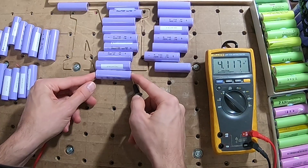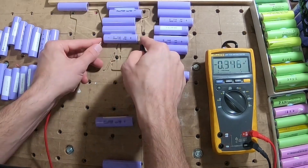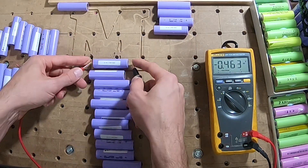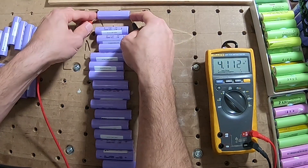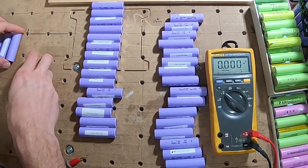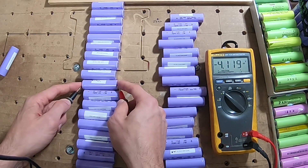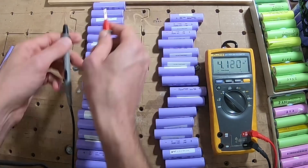As you can see in this video, I'm keeping everything above 4.1 volts. If it's below 4.1 I just pull it out of the pack, and then I continue going until I get enough cells to build the full pack with at least 4.1 volts. I don't think it's too bad if it's 4.0 or even 3.9 after sitting for over a year, but that's just something I decided to do — I'll use the other cells for something else.